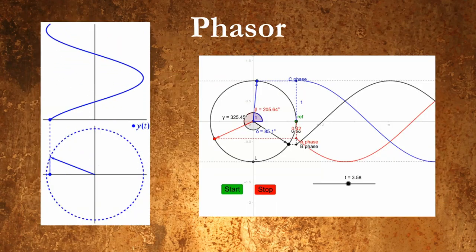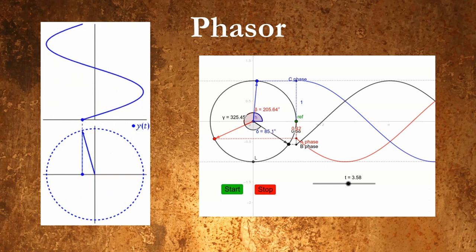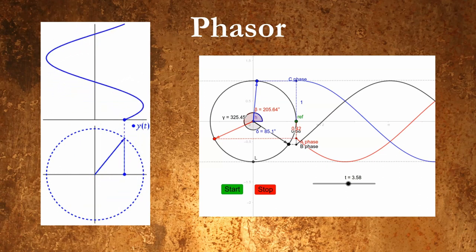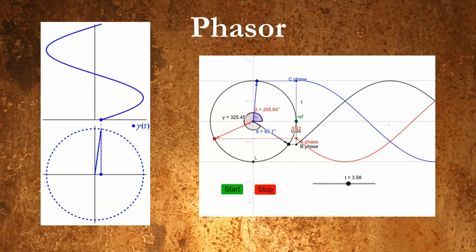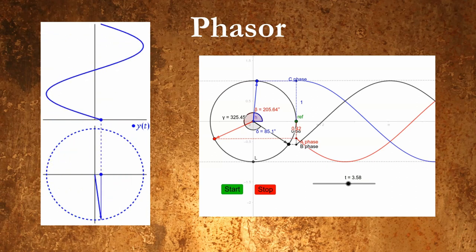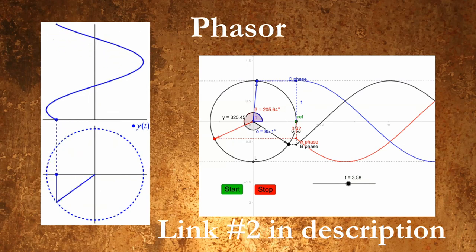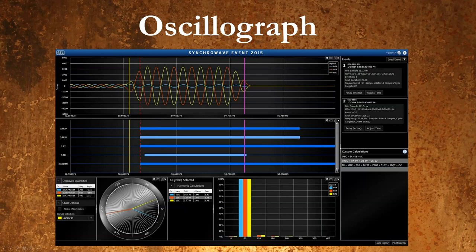Phasor diagrams are used in electrical engineering as a visual representation of different measurements along a sine wave. Since sine waves are difficult to parse when there's more than one on a plot, we can look at instantaneous values on the circular phasor diagram and compare the leading or lagging angles between phases of voltage, between voltage and current, voltage from two different sources, or the synchronization between two sources. Often the zero degree reference is the A-phase voltage and all other angles are compared to that. Phasor diagrams are the static circular plots. Oscillographies, on the other hand, are needed for very specific analyses — typically you'll only see these in the field from relay event files. Engineers use these tools to pick apart exactly what caused a protection device to trip or the order that things happened. This is a screen grab from SEL's Synchrowave event analysis software.